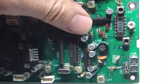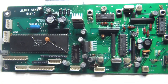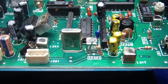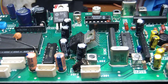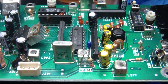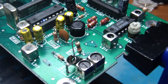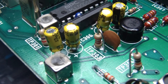Now it's time to change the electrolytics. This PLL board has now been recapped, cleaned, glue removed, and it's ready to be installed back into the radio. One note: this is a dual-sided board, so removing capacitors is a little more difficult, and putting them back in is also more difficult than with a single-sided board — you have to make sure you're getting solder on the top side of the board as well.